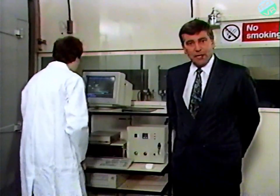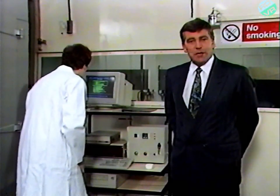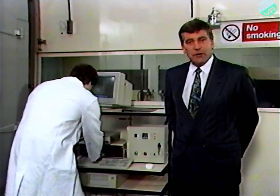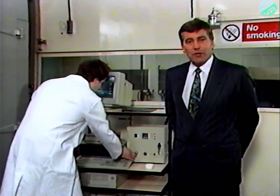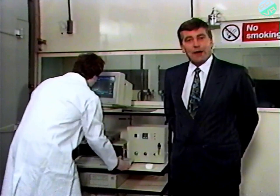It's known that there is a minimum effective size for a paint particle to be of value in a spray pattern. If it's too small and light, it'll be easily blown away as wastage. So let's return to the booth and see how the Duotec JGHV can adequately match the performance of the conventional gun in both speed and finish.